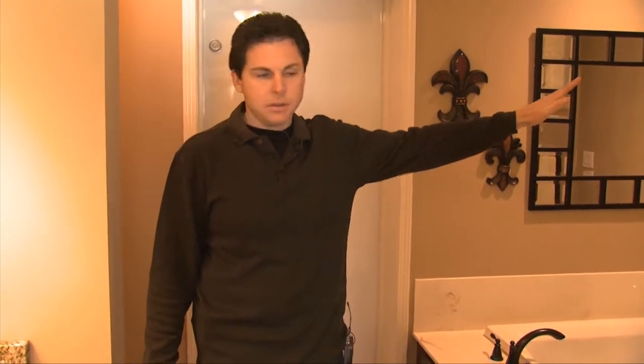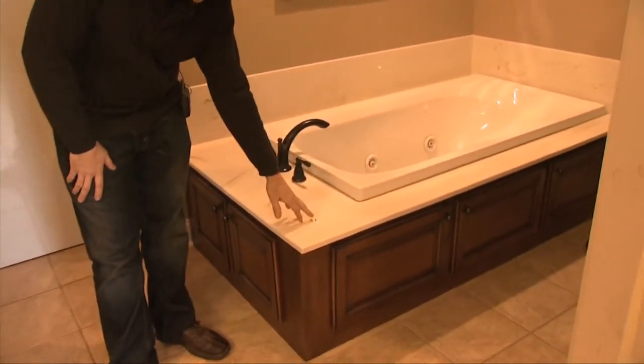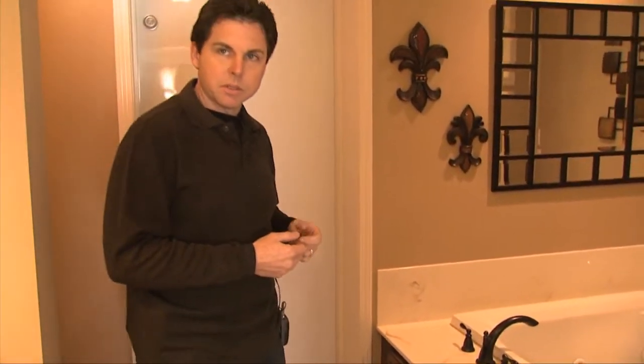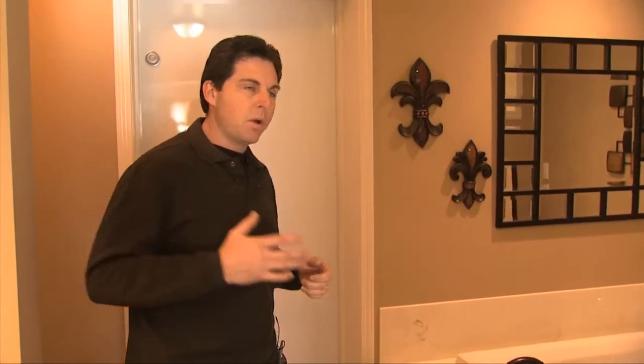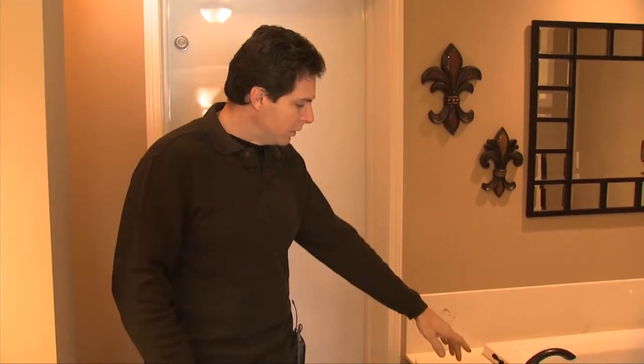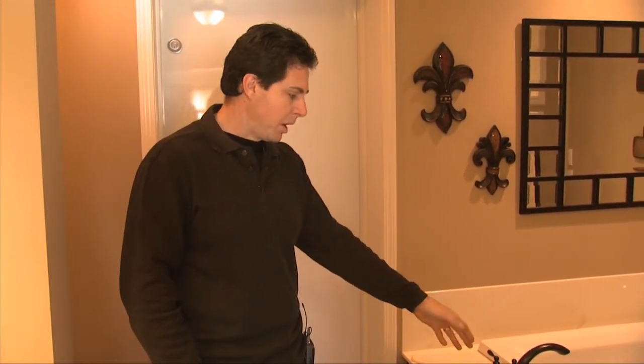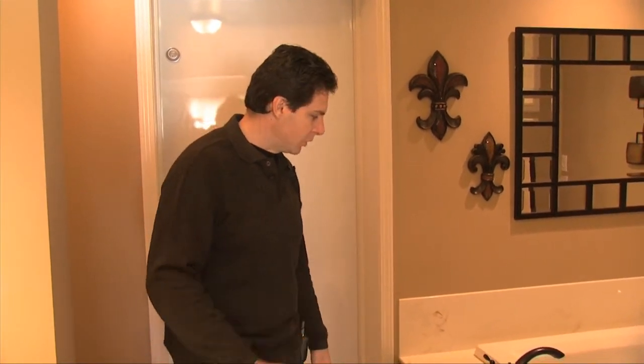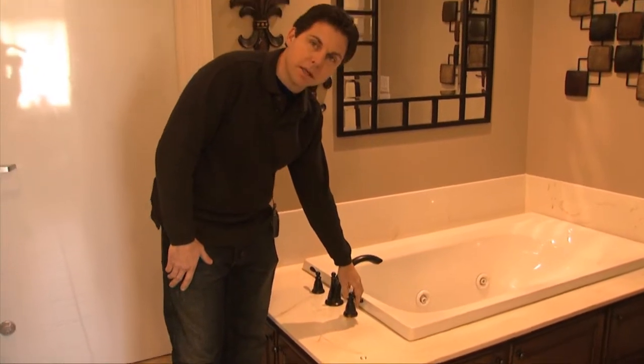You notice the water heater was way down at the other end of the house. We have a little button right here. Press this button — it kicks in a pump that's under the tub that has a temperature sensor in it. It recirculates the water back to the water heater. It's not a constant recirculation system because that would be wasteful. So when you get ready to brush your teeth or take a shower or take a bath, just press that button. It takes about 60 to 90 seconds for that pump to shut off, and when it receives hot water, the pump will shut off. Then you can turn it on and you've got pretty well instant hot water.